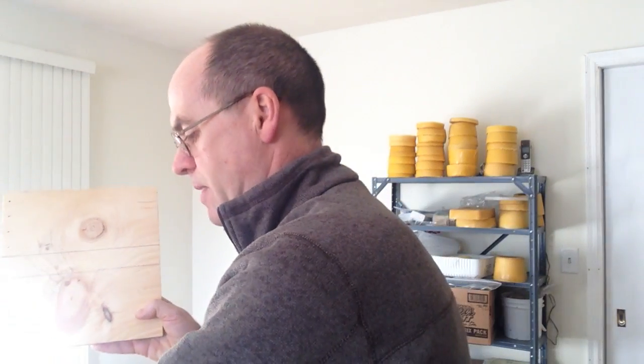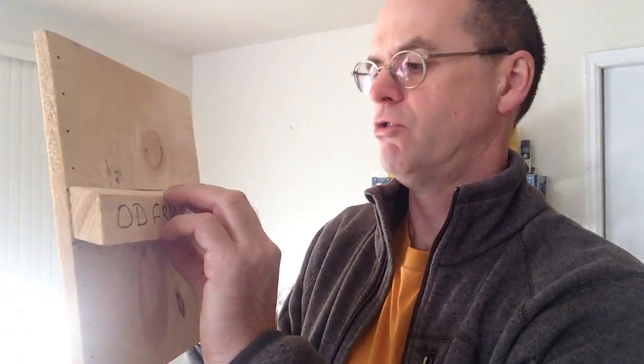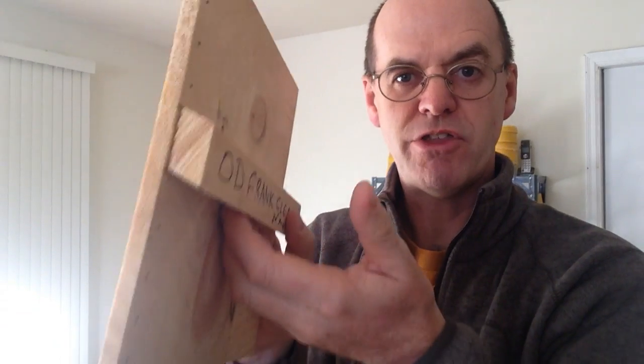After the glue's dried, I use 6D two-inch galvanized box nails. I've made a little stick — this is the top of the box — with nine nail holes marked out on the side. There's a big gap in the middle because after the box is all glued and dried, I put the cleat on here, glue it on, and hold it with just one nail on each side. The glue is enough to hold it and doesn't need further clamping. I like these cleats because they just bury themselves into your hands.